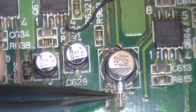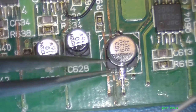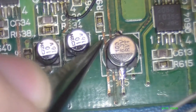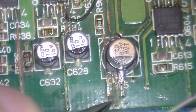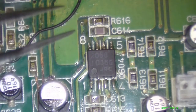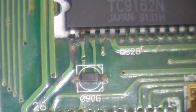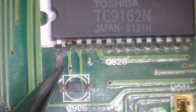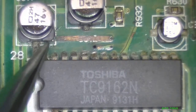This one here is actually broken right here — if you notice, there's no copper in this. So we're going to have to put a jumper to restore this connection. And this one here appeared to be okay, just missing its coating. So this area might just have to get rerouted and conformal coated over. This appears to be intact. This looks like a little issue I'm going to need to clean up here — again, I think this is a power supply pin, and possibly here too.